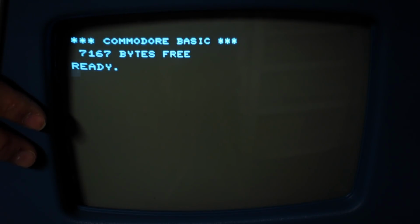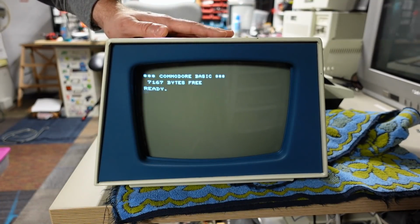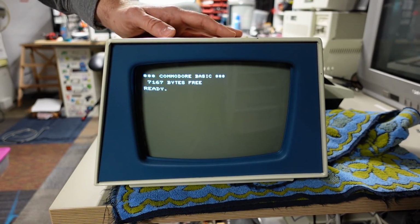Monitor is clearly working fine with that 2.7K and the new 33 volt Zener. Let's turn it off, see if we have a spot. I'm fully expecting that there might not be a spot right now, so I need to leave this thing on for maybe an hour or so. Yeah, we're not getting any spot at all. So I'll turn this back on and then I'll leave this running for about an hour and we'll see it.